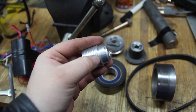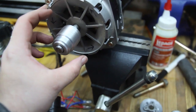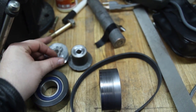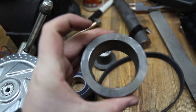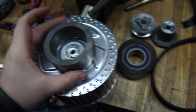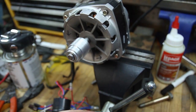That is going to have a set screw put in it right there, and then we're going to go ahead and put that onto the shaft. It needs to be shimmed a little bit, so we're going to shim it with some aluminum pop cans — we've got lots of beer cans. We're probably not going to use this one. If this works, we'll be transferring the bearing back in here, tapping probably three or four holes to try and get this thing centered, and then attaching that in there along with the bearing. Then mounting that to a surface and then that to another surface.